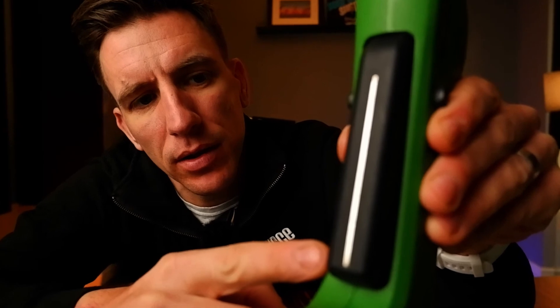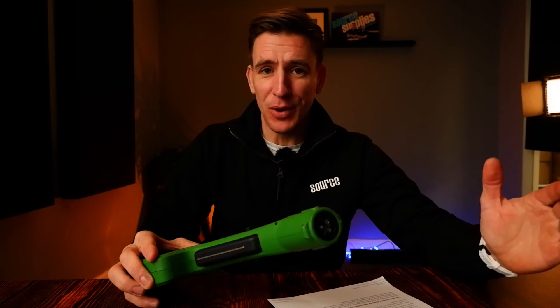Number four — this one's a bit quirky — wear a rubber glove on the hand that isn't pressing the trigger. And going into the fifth point as well: wear a glove on your other hand and make sure that on the trigger hand, you can see there's a little metal strip — that's called the grounding strip — and if your bare hand is on there, then that's good. There is another point in this document from Victory that answers the question of how you dissipate electrostatic charge, but that's where my limitations find their glass ceiling, so I'm going to refer that process back to the document linked in the description below.